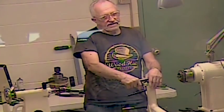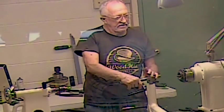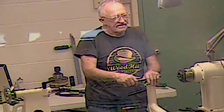And he writes that you can also make a bowl, once-turned bowl. We all know what that means. But he recommended that you do a twice-turned proper bowl. You got to turn it once and thick and let it dry for a year and then turn it again.